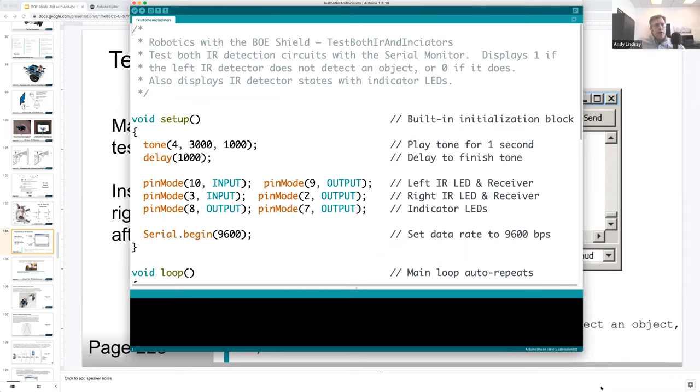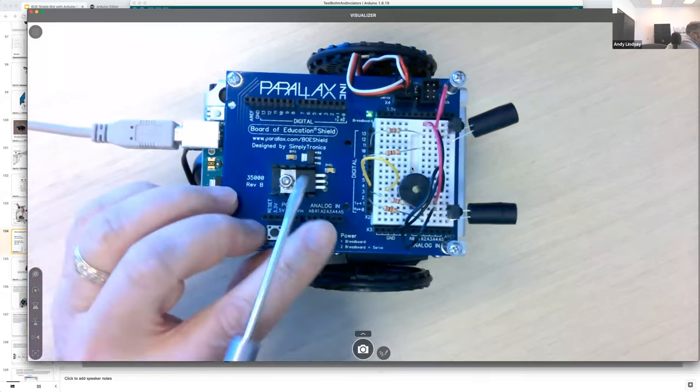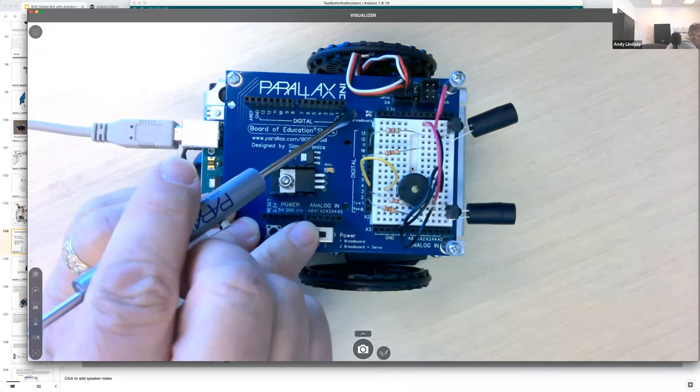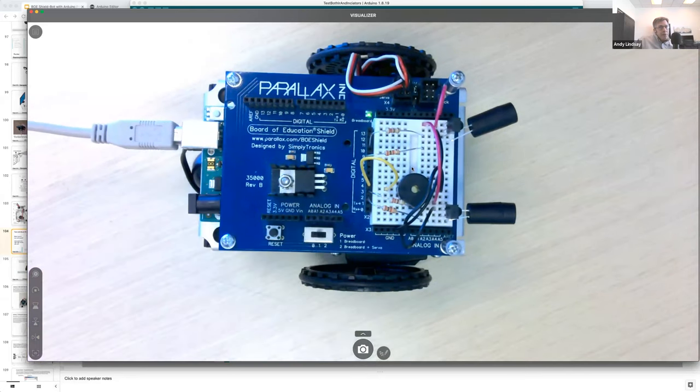I still don't need to plug in the battery power yet. Just set the switch to position 1. One important thing is that when you set the switch to position 1, check for this green LED to come on. See the green LED that's going off and then back on? You want to make sure that green LED is on. If it doesn't come on, turn the power off and recheck your circuit for a possible mistake.